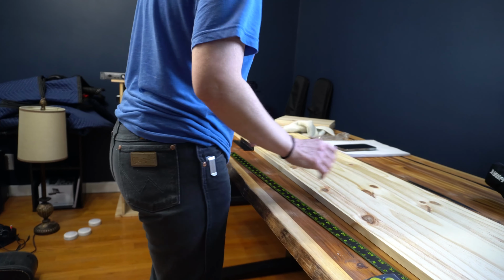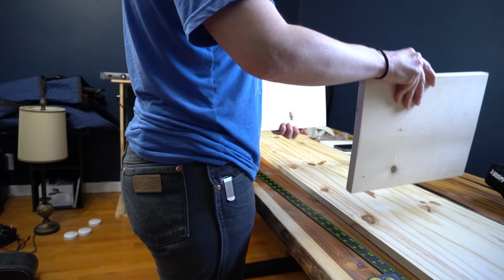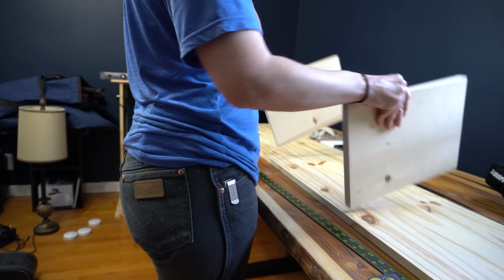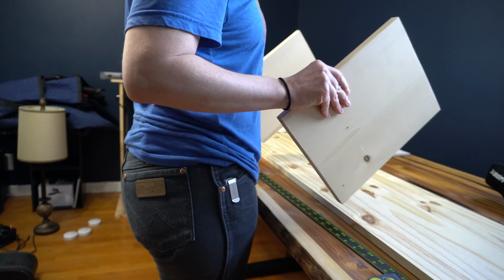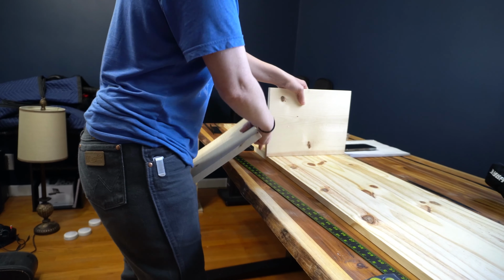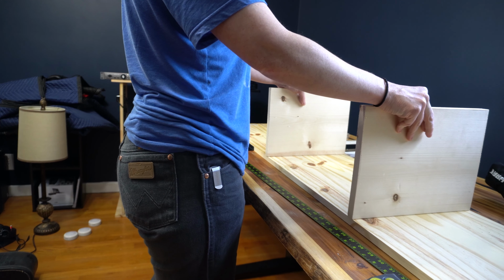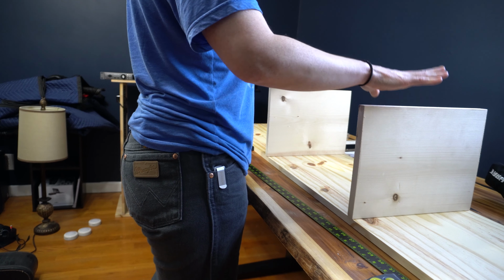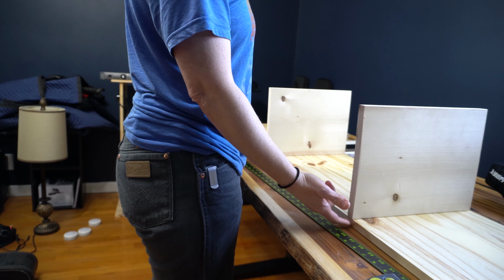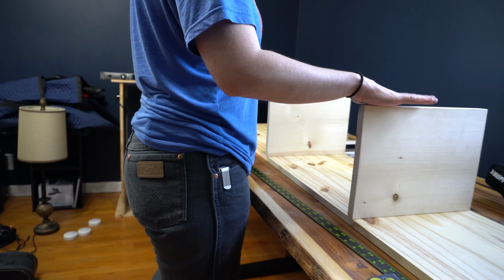And so that is where we're going to put our legs for the first one. And since this is the 19-inch mark, the mark is actually going to go on the inside of the legs here. So the first thing we'll do is glue these down and let those sit, and then we will put some screws in on the top side to really connect each of the legs.